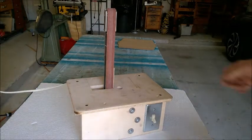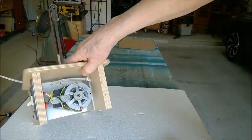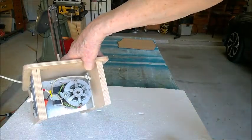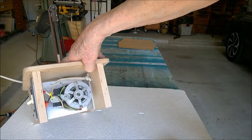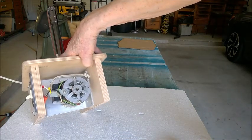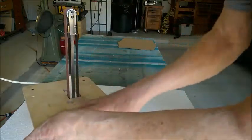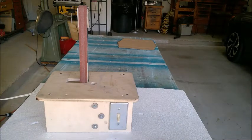One other note: the motor and belt assembly are attached to a piece of aluminum U-channel that's six inches wide and almost two inches deep on the sides. There's drilling and threading done on that to secure the various pieces. The sanding assembly itself is all part of this metal assembly, and then the enclosure is attached to that. That's about it — thanks for watching.